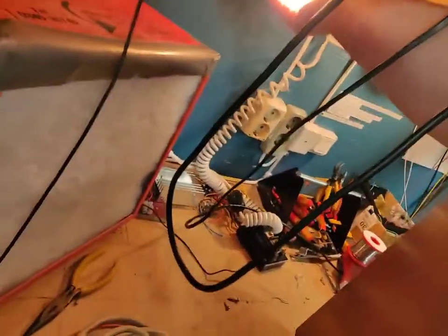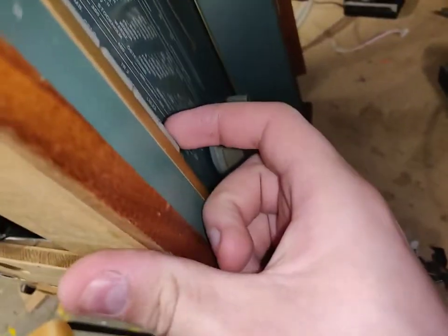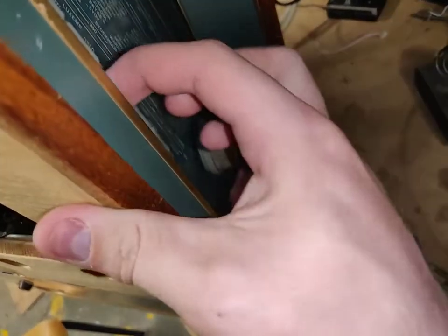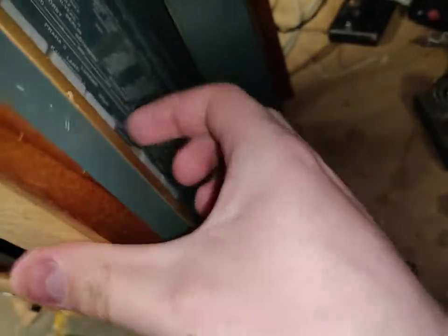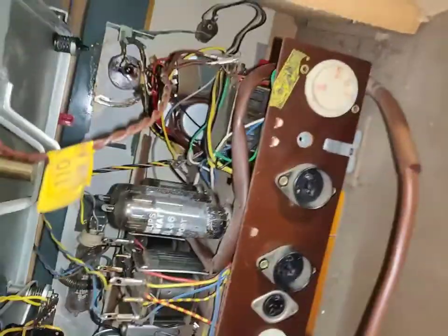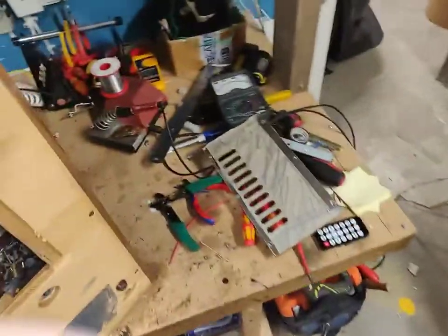This is a bit safer. Not ideal, but safer. So unscrew one of the bulbs. So we have 60 watts of current limit. Let's plug it in. And let's see what happens. Nothing. Absolutely nothing. Completely dead. So this thing has probably blown a fuse somewhere. Completely dead. Huh. It's weird. They usually don't die completely.